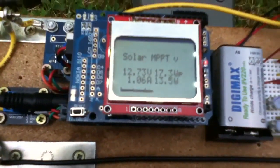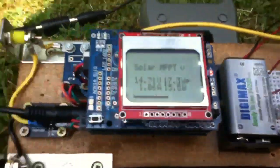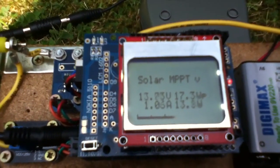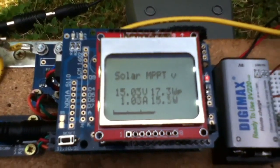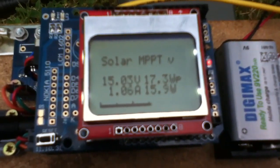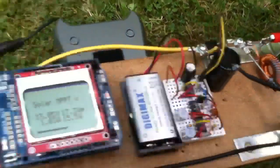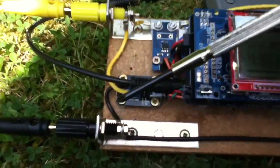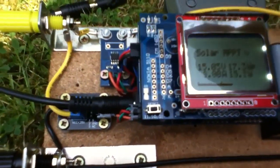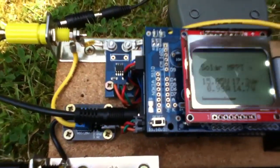Also, because I'm now switching — let's turn it back to switching — voltage on the solar panel coming up, trying to maximise the power. I'm now getting a fairly jittery voltage reading. It didn't jitter before at all, and now it is, probably because of switching noise being caused here in the buck converter section. So what I might do is put a capacitor across the solar panel here where the voltage measurement device is. I'm also getting quite a noisy measurement on the current — that's always been the case, this sensor does seem to be noisy.